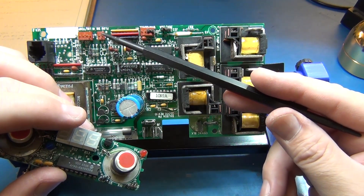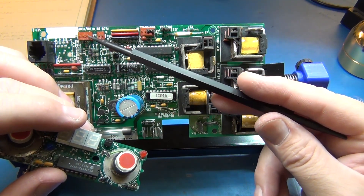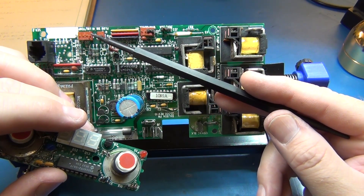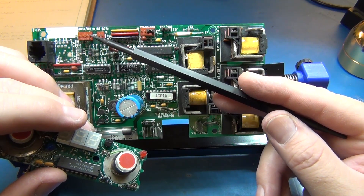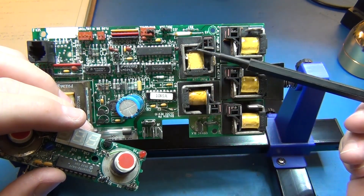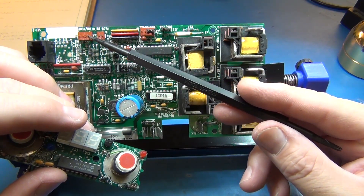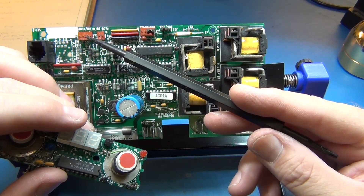It won't do that unless it gets a few proofs. One of the proofs is a couple of wires that go over to a temperature sensor in the water flow pipe. If that gets too high, it will turn off the heater, knowing that something is wrong — it's overheating inside the water flow pipe where the heater coil is.